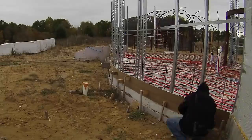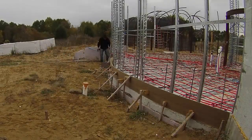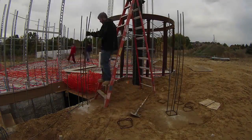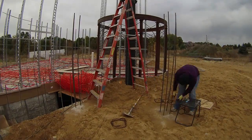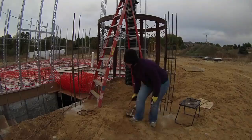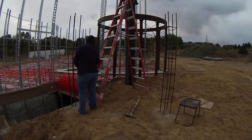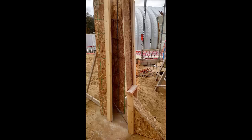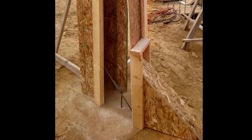I also needed to reinforce the north perimeter — I ended up bringing in dirt with the skid steer to pile up against it. I also had to put a couple of columns together, starting with the rebar skeletons which Sherry tied together while I built boxes to form around the rebar. The little triangle piece at the bottom is to resist lateral forces on the column before the adjacent walls go in.